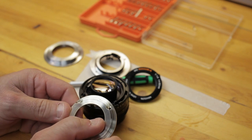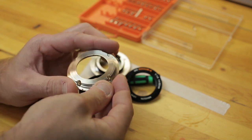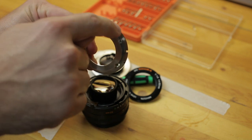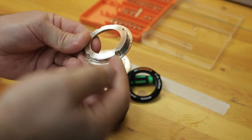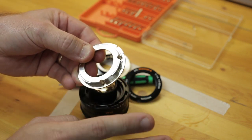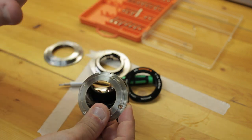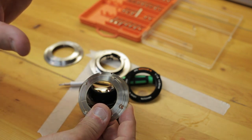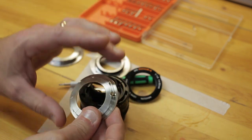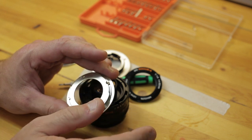The last thing I did with this mount in the drill press was try to cut out half of this bayonet lip area because of where the holes came through. That was the most difficult and frustrating part — using various Dremel bits on high RPM and the drill press. Getting them to line up with the holes and getting a nice smooth cut, even though it's soft material, is very challenging. You really need a mini CNC machine with some good end mill bits.